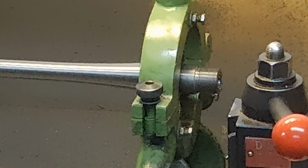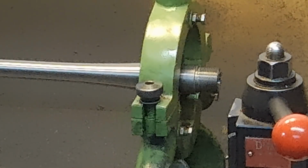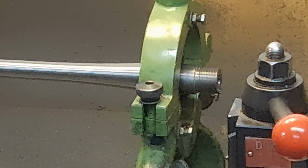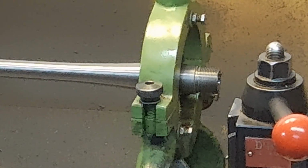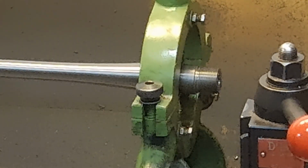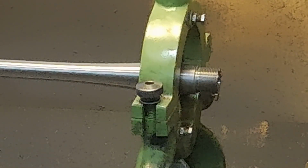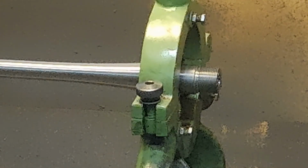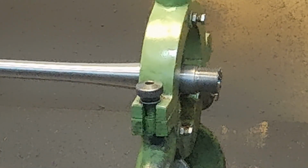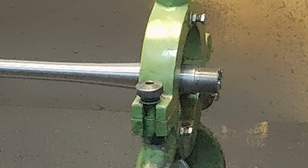I went in about 5/8 of an inch for that first cut. When you're not reaming too much, you can kind of push the reamer a little bit, and you can go in there quite a ways. And again, we're going to stop and check the rear end of the chamber and reach up in there a ways and check that too, just to see what we're getting.